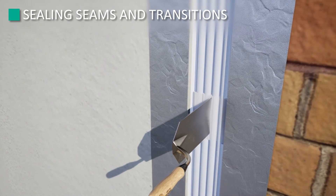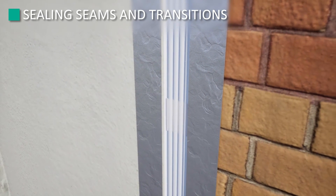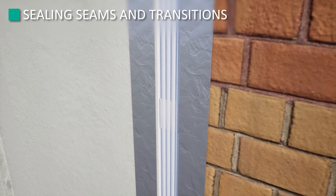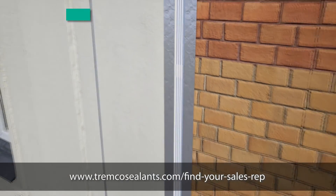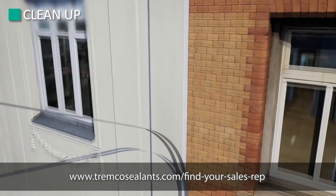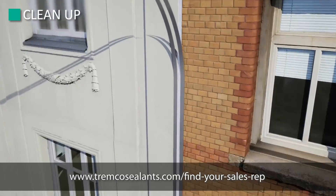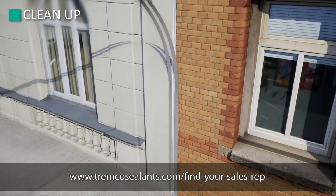Note: it's important to check that the bellows line up at the butt-joints and that the butt-joint sealant and seam sealant have not glued the bellows together. It is important that the bellows expand and contract independently, as this is necessary for the joint to function properly. Be sure to remove any excess adhesive material left on the surface of the substrate — do not allow the excess adhesives to cure. Finally, remove masking tape from the sides of the joint. If you have any specific questions, please contact your local WillSeal sales or technical representative.